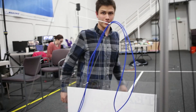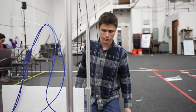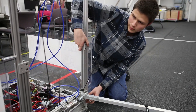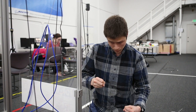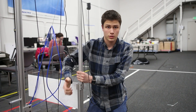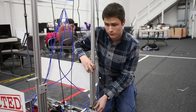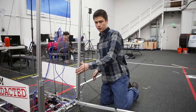Last night you guys probably saw that things weren't working so well. As we were trying to even just pull this by hand it took a huge amount of force. That was because these two linear bearings were really really close together, which means the constant torque from the load was not distributed over a very long distance, which means there's a large force against the sides by the linear bearings, which translates to a lot of friction. So to fix that we spread these apart, which reduces that force. And as you can see it works pretty well.